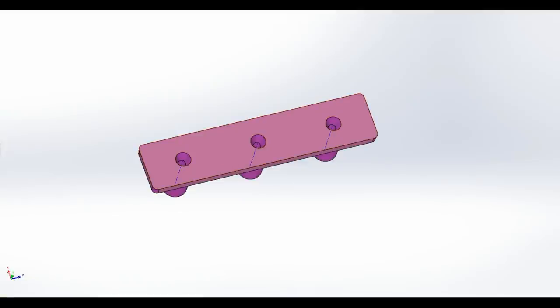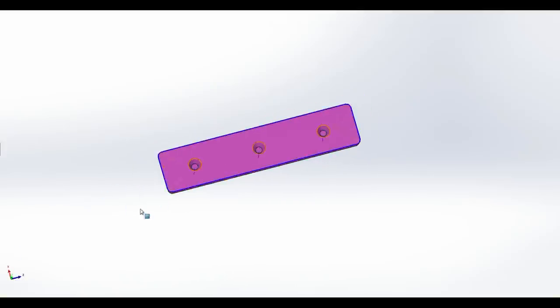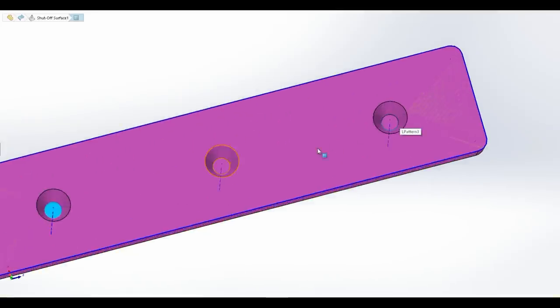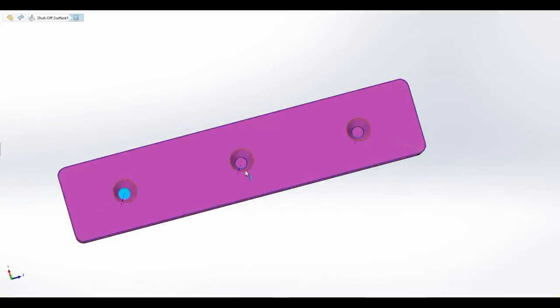And then you set up a parting line. And this blue line basically says where the mold's going to open. It's the demarcation between the two mold halves. Next step is shutoff surfaces, and you add these little surfaces here so that the CAD system knows these are going to be through holes, so put a temporary thin surface there.